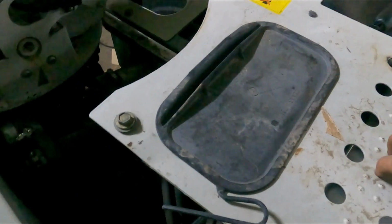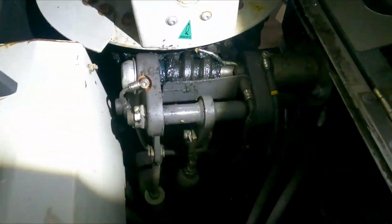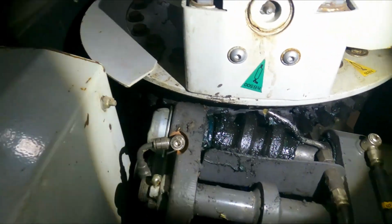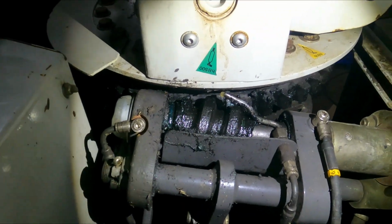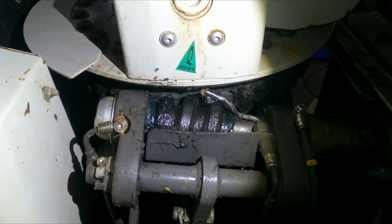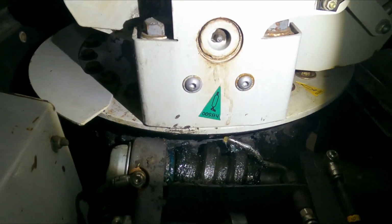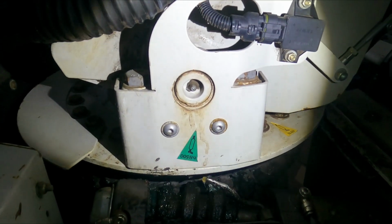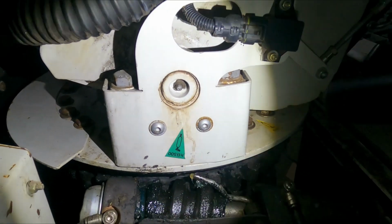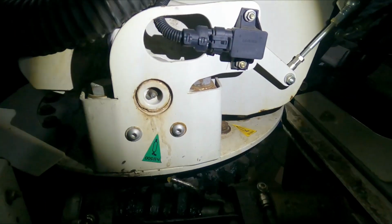And you take this out of the way without knackering your camera. Now you can check everything here is tight, everything here is correct, that the turntable's getting enough grease. Here, the main bearings of the chute, they also have to be greased manually. So get your grease gun and grease that.